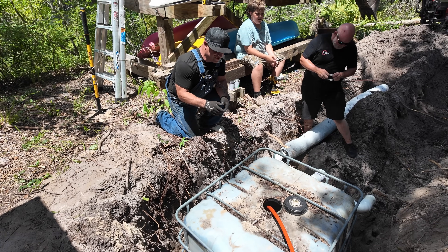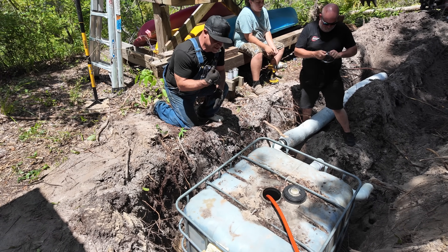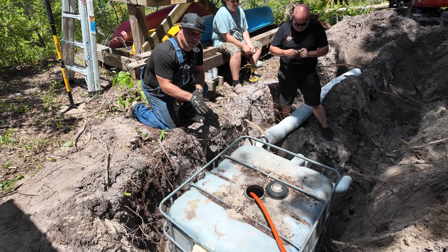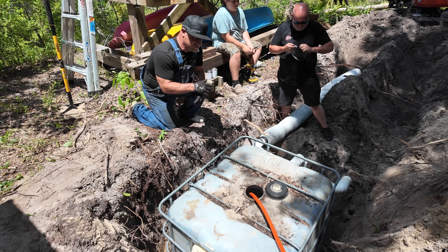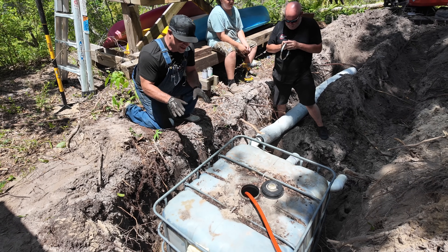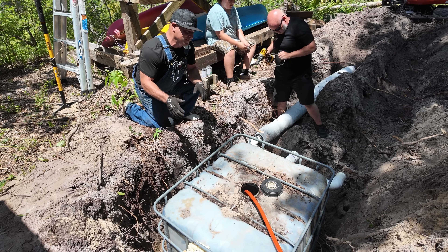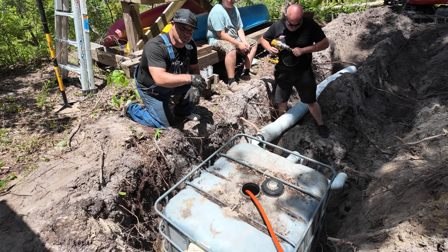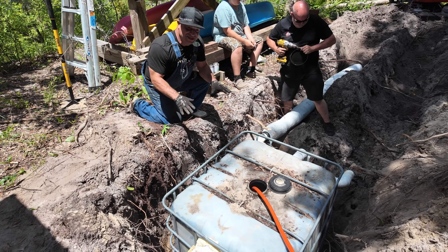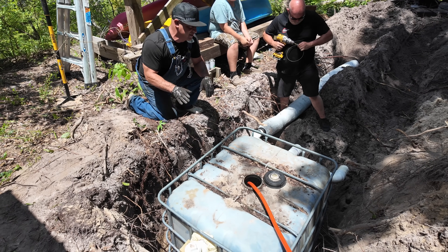As we're putting in the septic tank, one very important thing — and this is a mistake I made — is filling it with water to stop it from collapsing. A lot of other YouTube videos had no mention of this. When you fill it back up with dirt, the dirt is going to start pressing in. Fill it up with water so it weighs down and pushes as much as it can. Then when you fill in the dirt it all becomes nice and even.